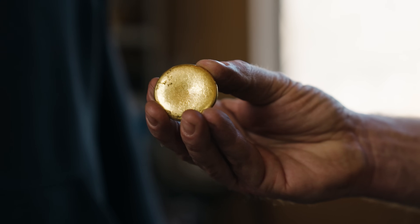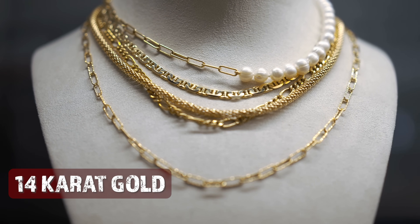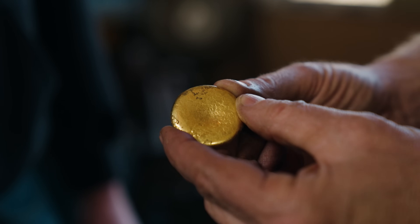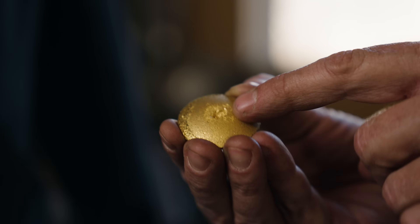I want to show it to you. Are you ready for the big reveal? That is a wonderful thing. Boy, look at the color of that material. I think a lot of Americans are used to seeing 14 carat, which is more of a yellow, whereas this has a little bit of green tint to it. And it's really heavy for its size, which is super cool. This surface is gonna hammer very nicely. We've got a small indent here where we're gonna have to just see how that is, because anywhere that might start a crack we're gonna have to eliminate, or the whole piece could break.